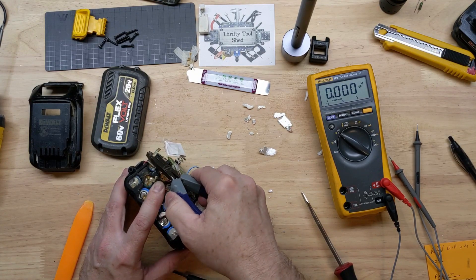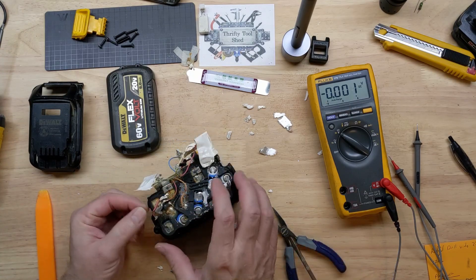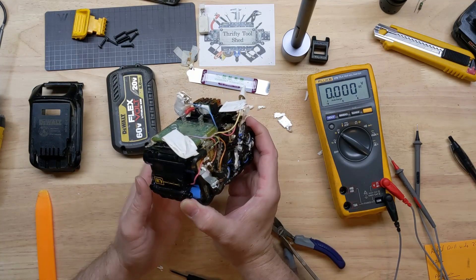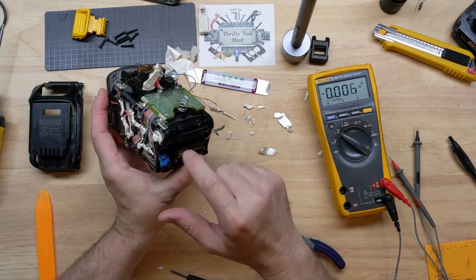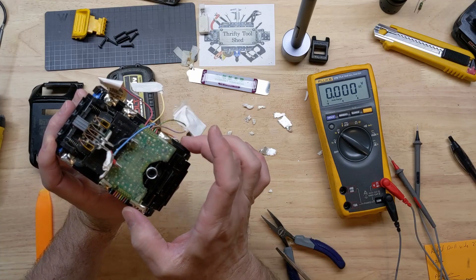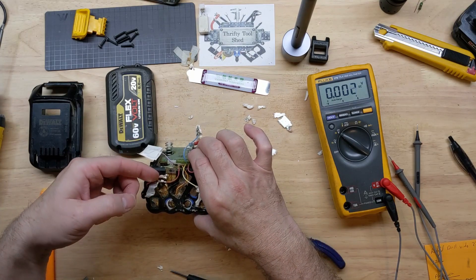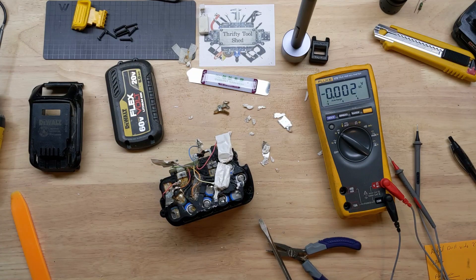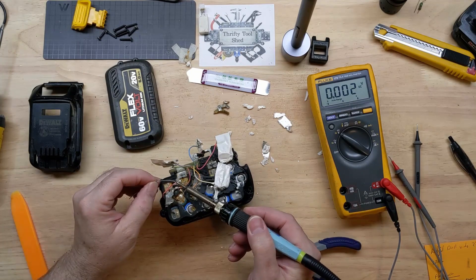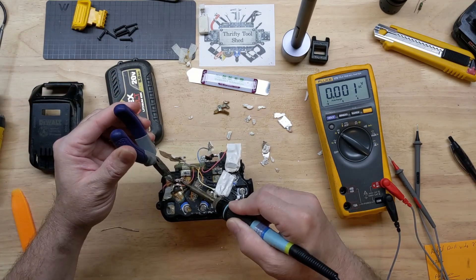We're starting to see — I can lift this up a little now. Our battery gauge here goes from here to here, so it looks like the battery fuel gauge just reads off of this 20-volt set here, and that's so short it might have to be removed as well. I'm going to take time to desolder from my battery fuel gauge here. Even with a soldering iron you have to be careful not to touch other metal parts or you'll short out, and as always there's a lot of mass and heat sinking on these solder connections on these strips.